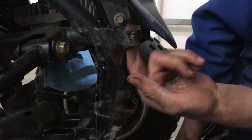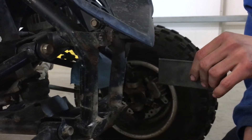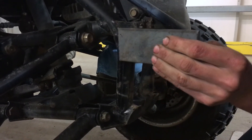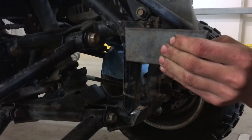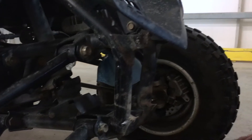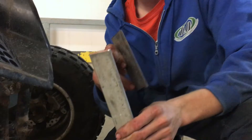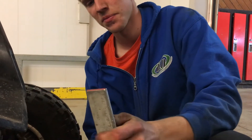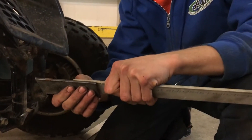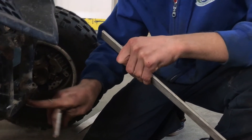I'm going to modify this completely — you can kind of see right down there, it's just completely messed up. I'm going to put these braces on partway down just like that, put a nice weld across the top of that mount and down the side of the frame. Then on the side of the bumper I'm going to have a little bit smaller metal that comes off the back of the bumper, off that plate, and that's going to bolt onto here so that this bumper will be removable. Then down in the bottom I'm still going to use that stock one bolt for the center.